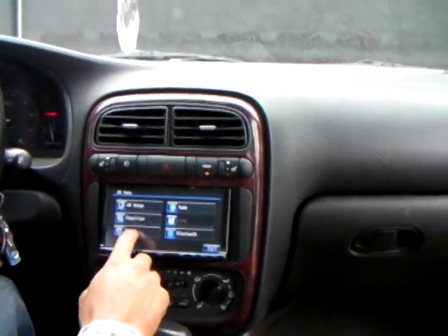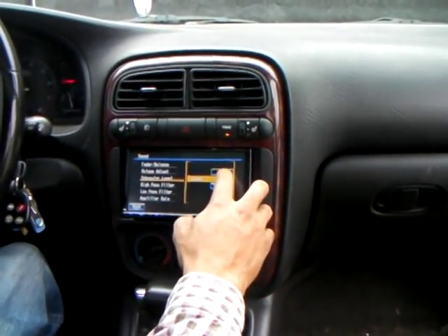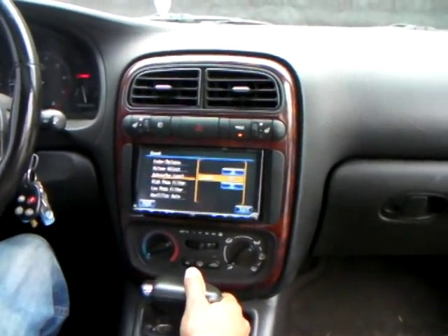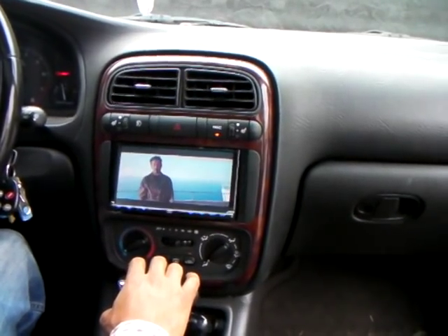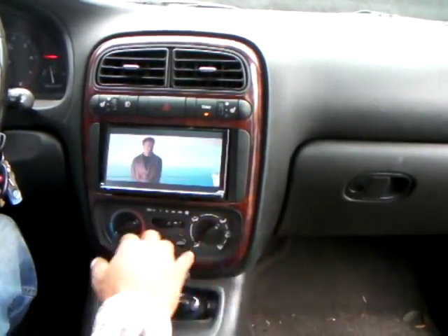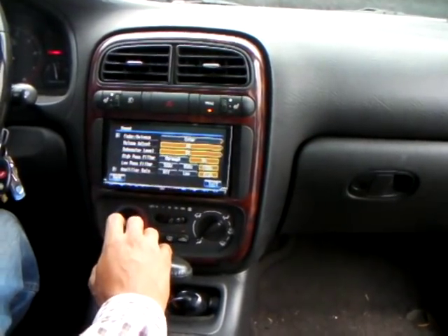You have subwoofers hooked up — you can instantly go to your sound and adjust your subwoofer level. Also, there's an internal amplifier in here. If you have speakers that don't go beyond 50 watts of RMS power, you can set this so that it doesn't send a whole lot of power to your speakers, blowing them up — it won't send your volume past 30. You can set all that up from your high-pass and your low-pass filters and your gains.